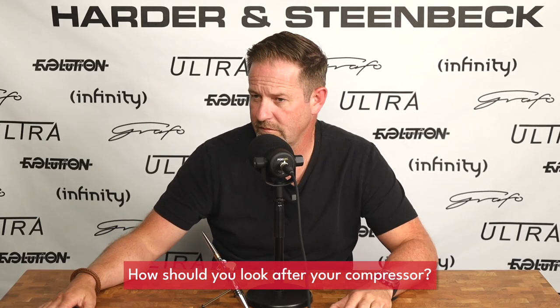How do I look after a compressor? The main thing to understand is that whether or not it has a tank, the job is to compress air — and when you compress air there is a risk that moisture in the air will drop out. On a tank compressor, moisture fills up in the tank. On a quality compressor you should find a valve low on the tank specifically to drain that moisture. To use it: charge the compressor until the tank is full, then open that valve — but don't point it at anything you don't want to get dirty water on, because that's what's going to come out.